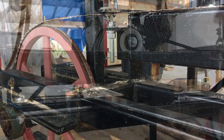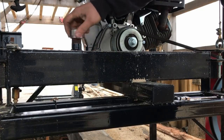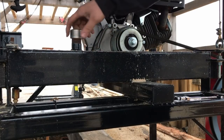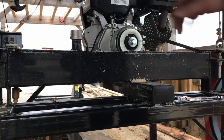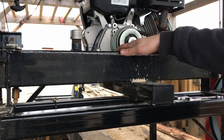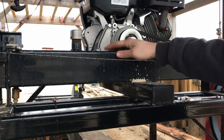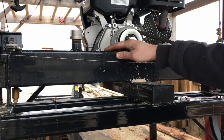This is a metal blade lube tank. This cap has a little vent hole in it so you don't create a siphon. I see a lot of people with Hudson mills end up putting a plastic tank on, and I've noticed it myself — the inside of that metal tank is going to rust, it's just standard mild steel. I will most likely be adding a plastic tank at some point in the future.